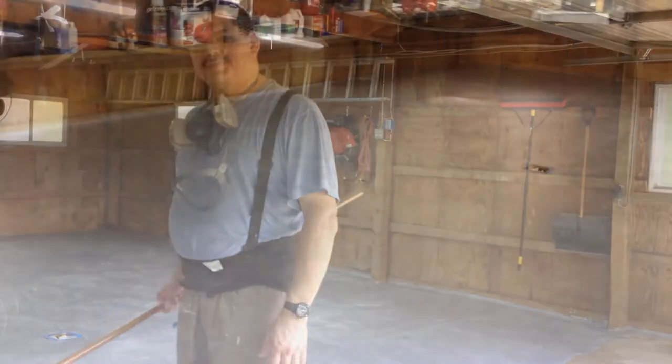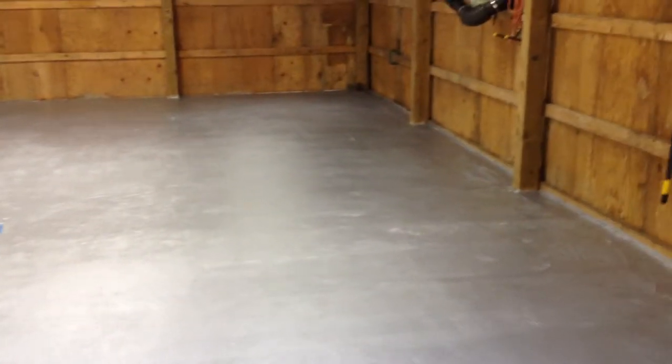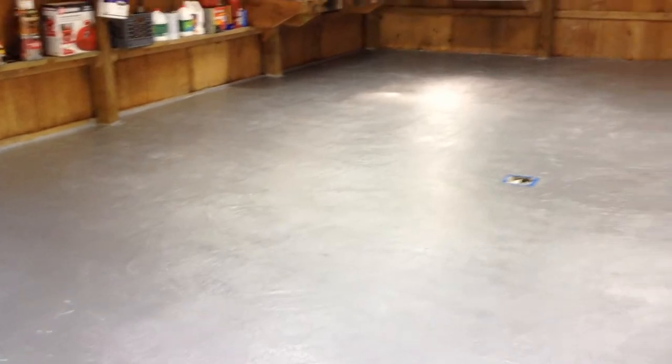Update on the second coat. First coat took an hour and 45 minutes to put down; the second coat took an hour. The garage is 32 by 24, so about 600-700 square feet. I've pretty much gone through five gallons with about a quart left. The floor was etched, and in some places etched pretty heavily. The etching won't really clean off grease, but if you keep throwing muriatic acid on it, grease starts to appear in the foam, so some grease is getting lifted — though I think it's at the expense of the concrete.